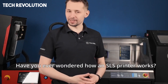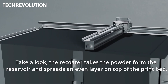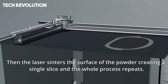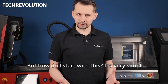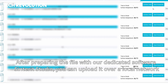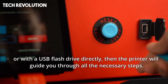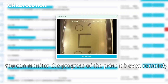The system supports a broad library of powders, including PA-11, PA-12 Industrial, flexible TPU-PP, and even ESD-safe materials, all within an open-parameter architecture that gives users full control over more than 30 adjustable printing settings. Ingenious features like the automatic air-blade glass cleaning system reduce maintenance by cutting clean-glass frequency by two-thirds, while the machine's four-zone thermal management and inert gas system maintain optimal print consistency and material reuse.